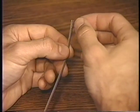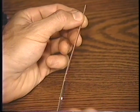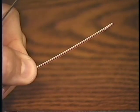When splitting ribbons, the new split ribbons must have straight and smooth edges. If not, there will be cleave and alignment problems later.